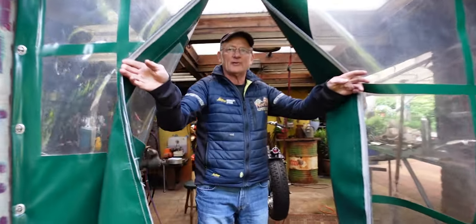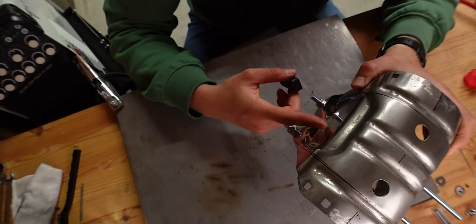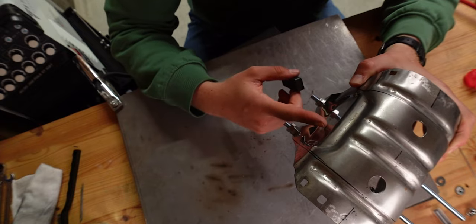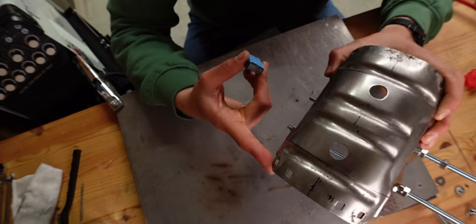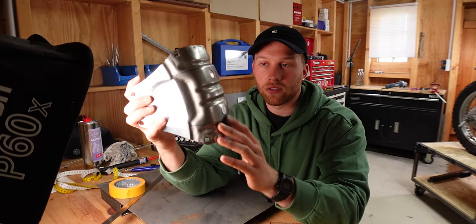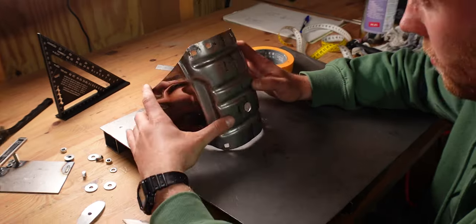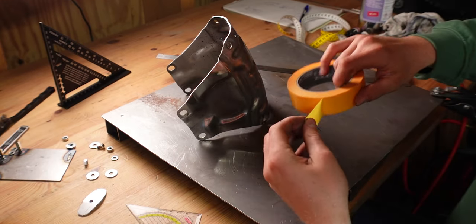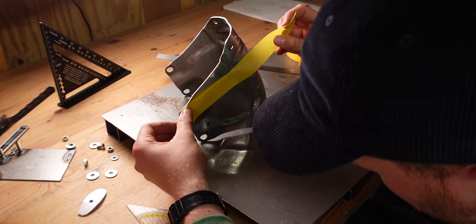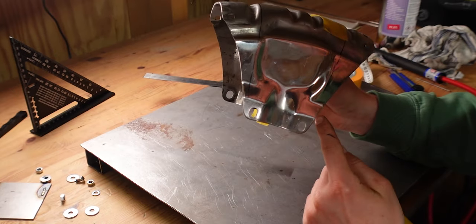So I went to Andy's place and asked him, and he said this is probably stainless steel — it's not magnetic but it's relatively heavy. If it was galvanized steel it would be magnetic, and if it was aluminum it would be much lighter and you would see it from the surface structure. It has all these structures at the top and on the sides. So I want to find a cut line that actually makes sense and looks good. Right here there's a tiny change of direction, so I'm going to start here and go up.